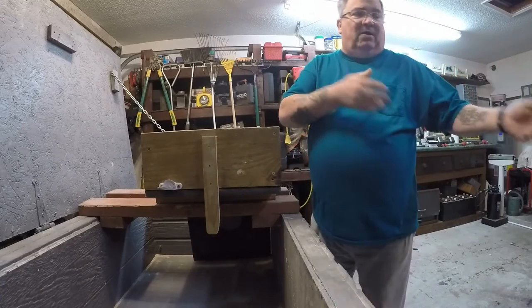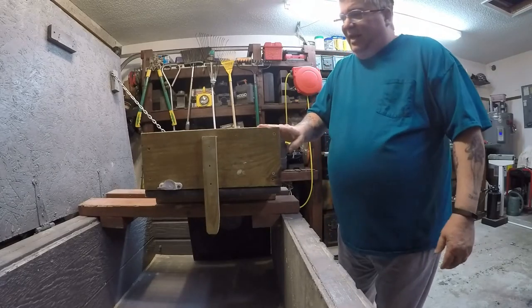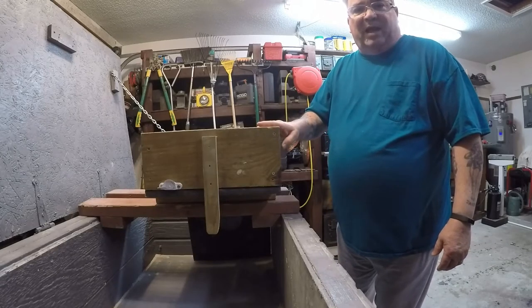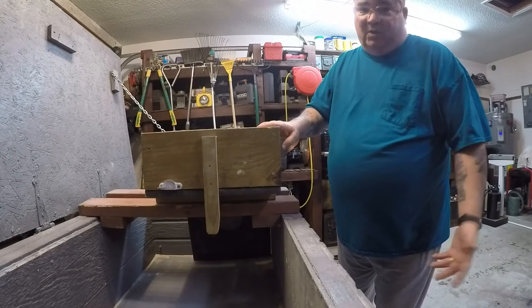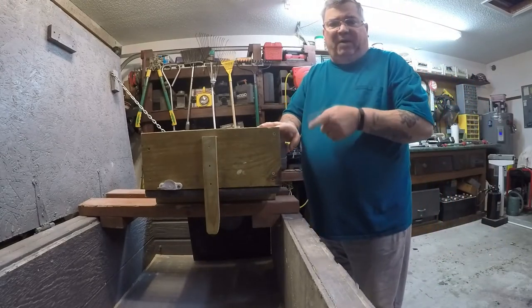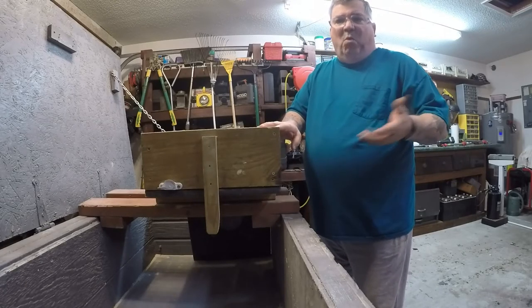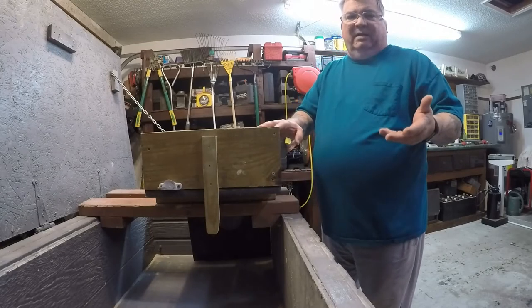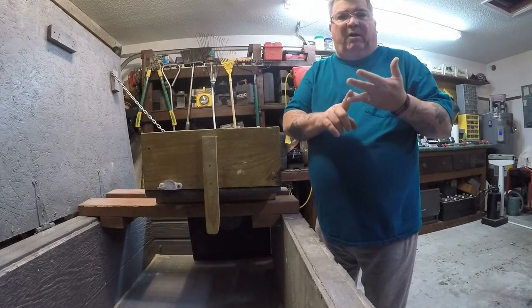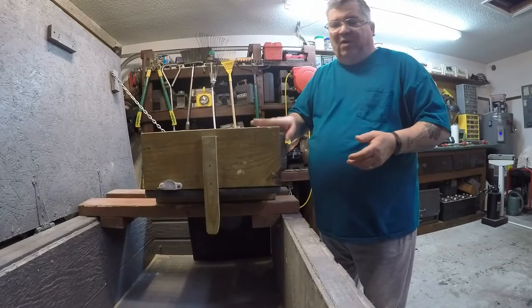After 10, 15, 20 of them I started getting a little bit strained in the back, picking it up and taking it over to the pouring deck. So I went and weighed it, and a 12 by 12 by 12 block of that petrobond sand was 79 pounds, almost 80 pounds. The petrobond powder and petroleum products added to that make it more in weight and density than just the bentonite sand and water mixture that I use here. Mine's going to probably be a little bit lighter.